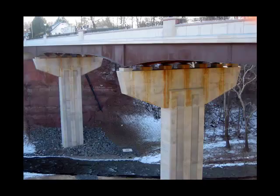The structural steel on this project is Cor-Ten steel, which is weathering steel. Weathering steel forms a protective layer on the surface, and that layer resists further corrosion. So this kind of steel does not have to be painted, and that represents a tremendous saving in terms of the maintenance of the bridge.